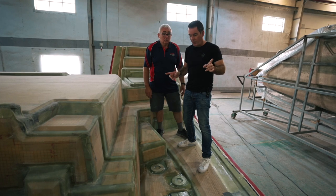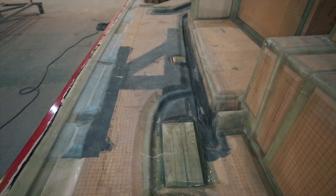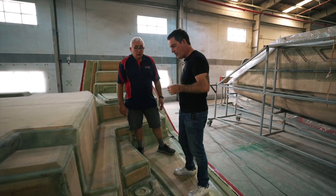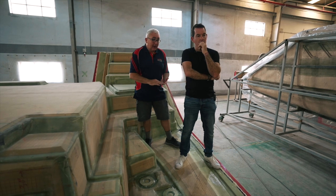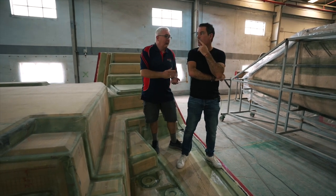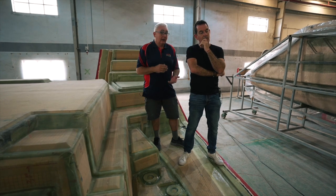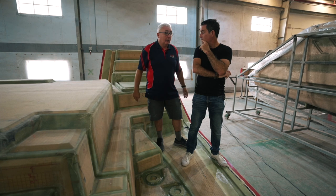You can now see the visual pathway: winch, winch, clutches, and then moving forward you can see the whole contiguous line where the line jack curves around to take the lines to the mast. Along the hull join there are also all the areas for cleats, expansions, and other upstands for deck gear. The backing plates aren't fitted yet because the hull join has to be done first — the backing plate would be in the way. After the join, in high-load areas it will be taped, then get the backing plate and be through-bolted. The through bolts are included in the engineering — the engineers counted in those bolts and determined they could use a certain amount of taping because of the extra mechanical fixing from the bolts.